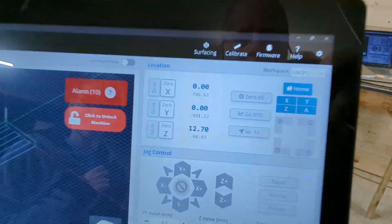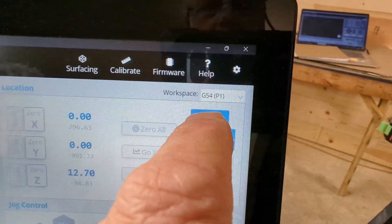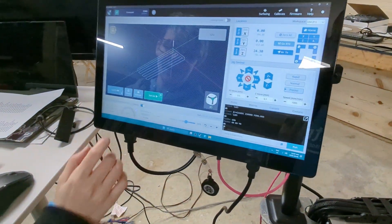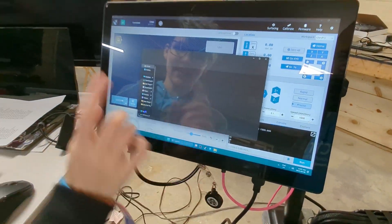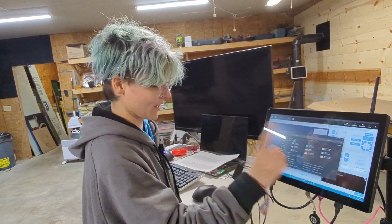I'm going to bet that it pulled up the wrong G-code. The work offset. I know why - because in my file it's G55, and G55 is not set to the proper X and Y.